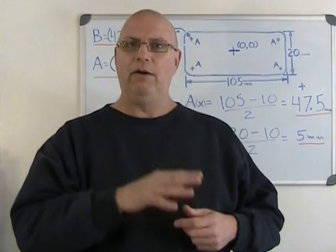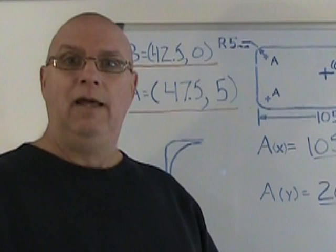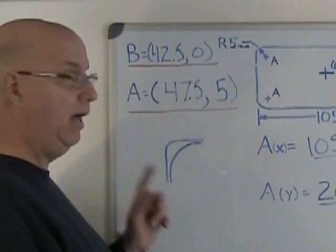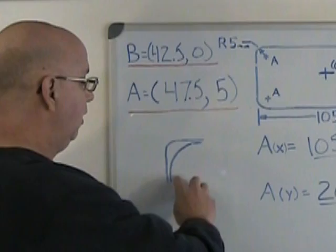So use a strong jet to cool down the tool, but in this case also to get rid of those chips. Another thing that's worth mentioning when pocket milling is that if you use a roughing tool that has a larger radius than your finishing tool, you're going to end up with a big difference in your corners, as we can see right here. Now, my 19 millimeter or 3/4 inch roughing tool has a quite large radius, whereas the 10 millimeter one has one that's much smaller.